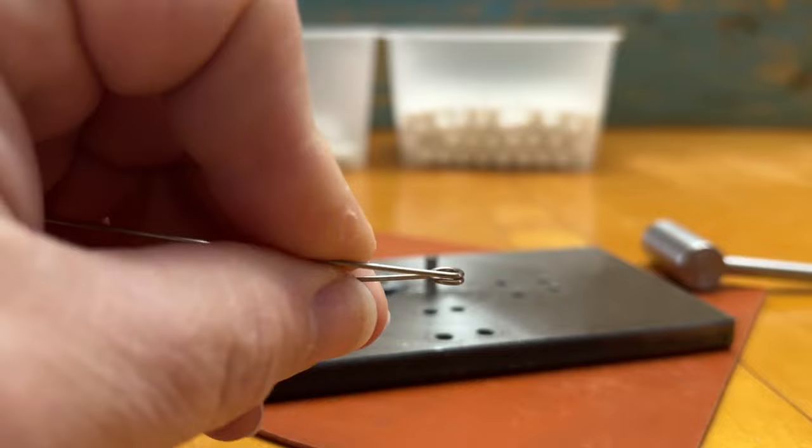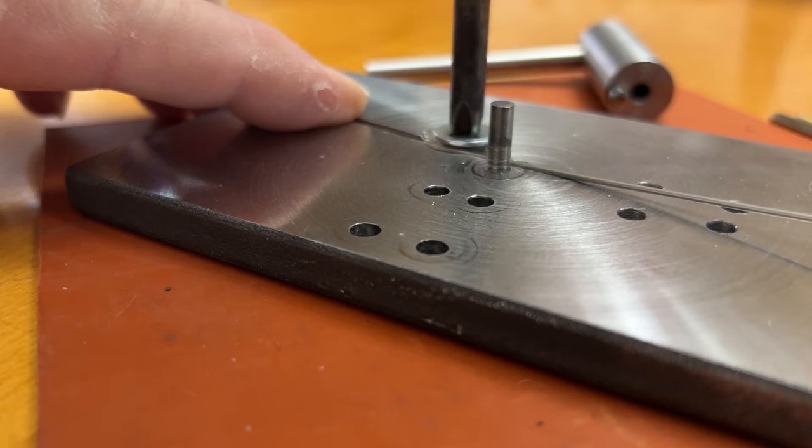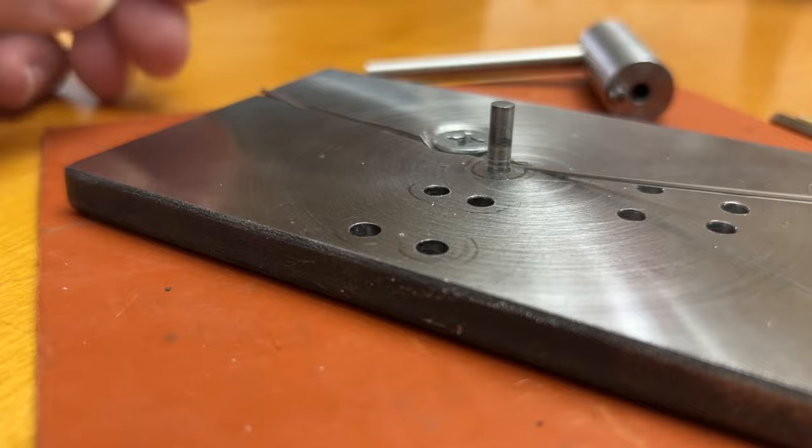I can already see groove marks on the pin that I made to fit the holes that were a little too big. But what I found worked best after I'd already drilled a couple holes was to actually drill the hole and use the drill bit end in order to make my pins. So you'll need multiples of the same size drill bits in order to make pins out of those, so you can cut the ends off and use those for your pins.